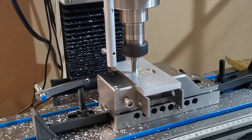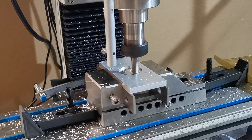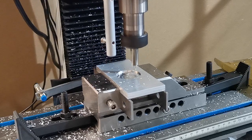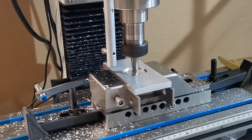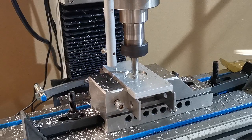Because we're now cutting on the side we're getting less wear on the tip of the tool. It's now going to go and do the clearance hole so you can put the motor on with a coupling. The size of this hole is something you would determine yourself.